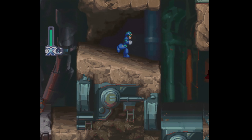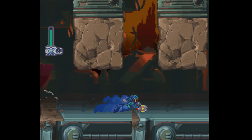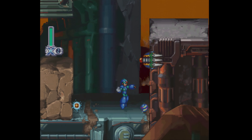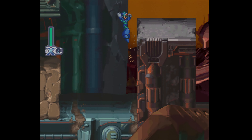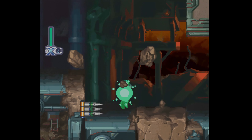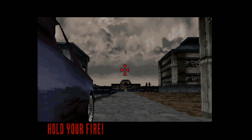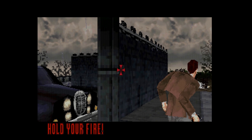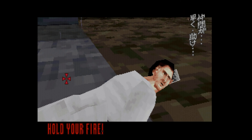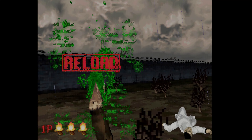If I just told you that I was scaling this at a 4K scaler with analog inputs and didn't tell you what I was using, you would probably just believe that. This is a very fun feature, and I understand why people wanted to see this in motion, because most of you have some sort of scaler in your setup right now — whether it's a Framemeister, an OSSC, or a RetroTINK that isn't the 4K — and you're wondering whether to upgrade to a 4K scaler with analog in, or let your television do the 1080p-to-4K scale, or invest in a RetroTINK 4K, or get away with the Morph 4K without the analog bridge. At some point the analog bridge is going to come out and you'll get the inputs in the back, but if you already own a scaler, you don't have to buy that extra accessory if you don't want to.